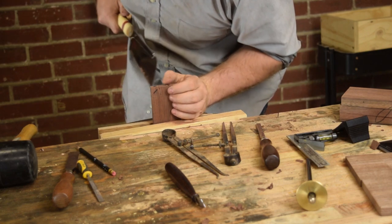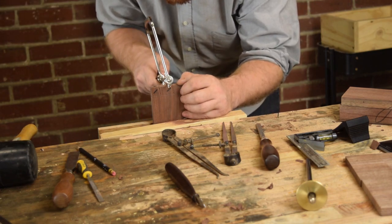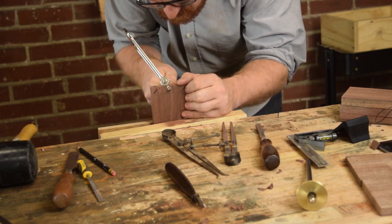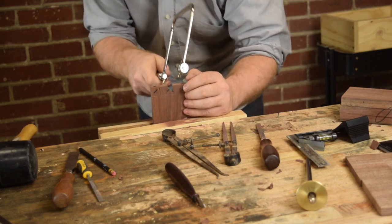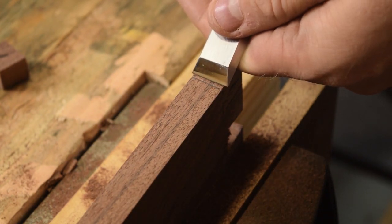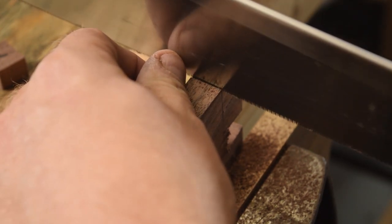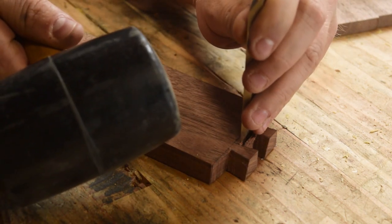There are a lot of easier ways this could have been done with a router jig or whatever you had around, but I decided to try these out by hand. Now, I've never tried this before, but I think it might be harder to match up the negative space in a dovetail than it is to actually get a perfectly fitting dovetail. The most critical part of the fit is really to have good clean baselines, so I made sure to clear out not quite to my baseline, and then clear it up with a chisel. I already went over a lot of these techniques in my dovetail video, so I'll link to that here, but these aren't really a traditional dovetail. The only practice you really get is cutting a flat baseline and just using the tools and becoming more comfortable with the overall process.